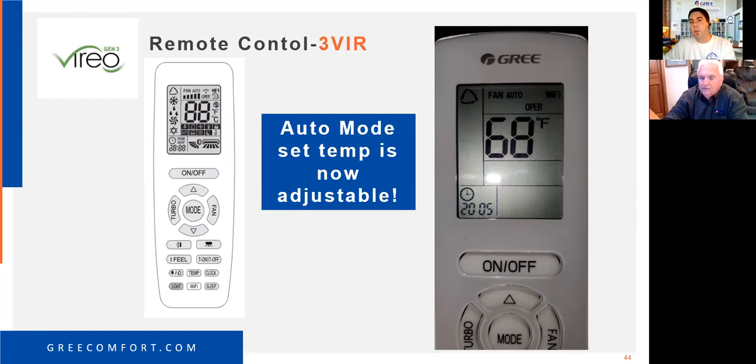The auto mode is new, and I've been asked this for 4.5 years: is the auto mode adjustable? It used to be set. If you put it in auto, it would heat to 68 and cool to 77, auto changeover from heat to cool. Now with the auto mode, it's going to auto changeover, but you can change the set temp. So if you want to set it on 68 in the auto mode, it will change over from heat to cool for your set point.